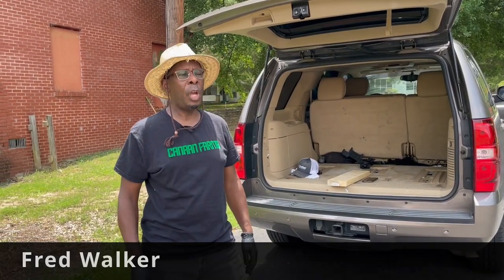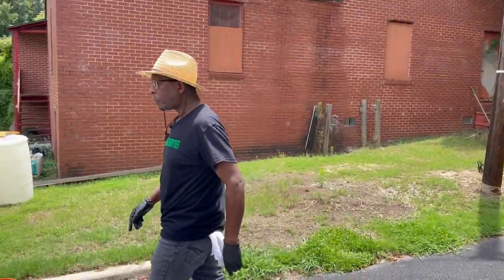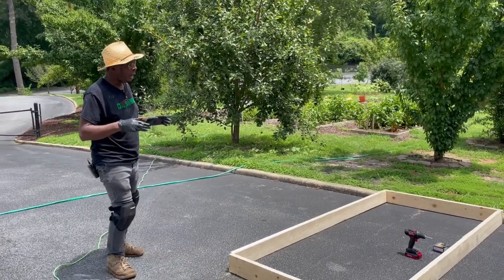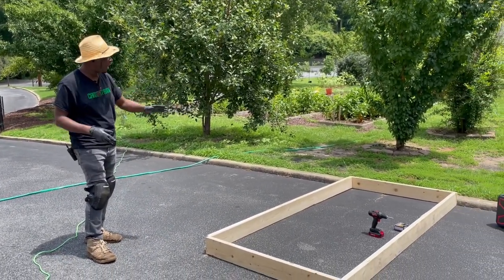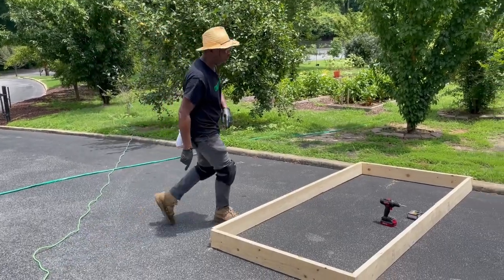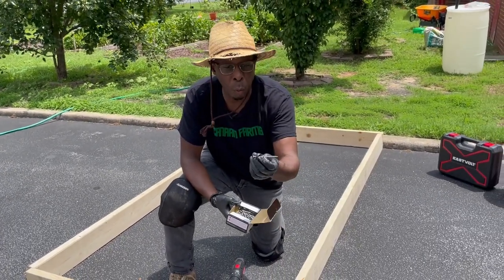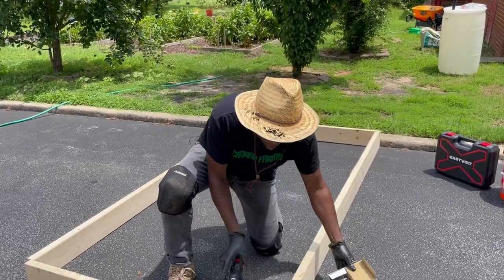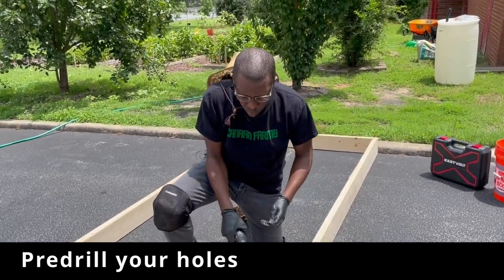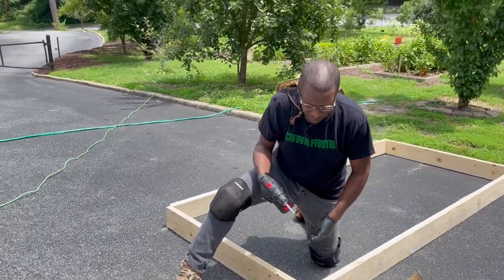We've made it back from Home Depot. We've got our supplies. Now we are ready to assemble our raised garden bed. Take a walk with me over here. What we've got are two by eight by tens, or two by eight by fours. And what we're going to do is assemble this raised garden bed here. We're going to show you how to pre-drill it, put the screws in, then we're going to go over to the garden and show you how to fill it. What we're using here are deck screws — you want to use something that's going to be more solid and hold your wood together. So these are deck screws. What we did beforehand, we pre-drilled the holes so it'll be easy for the screws to go in. All you're doing next is putting the screws in, so let's go ahead and see what happens.